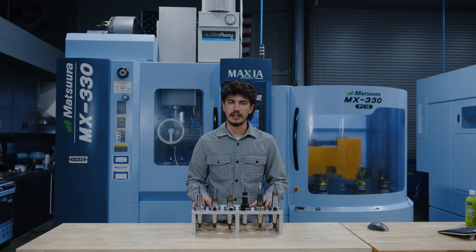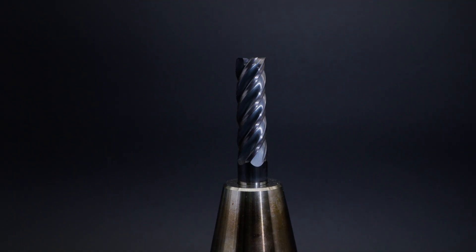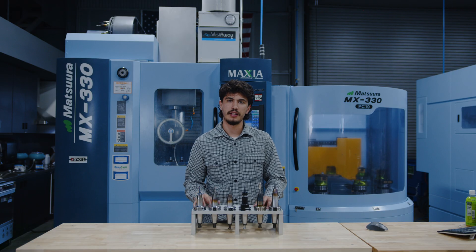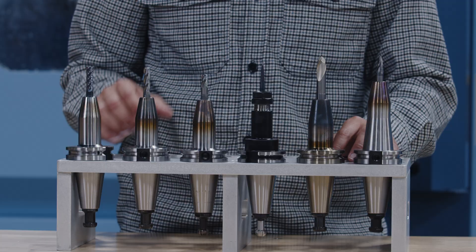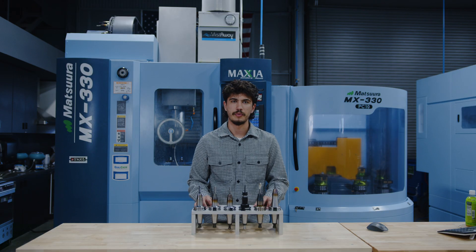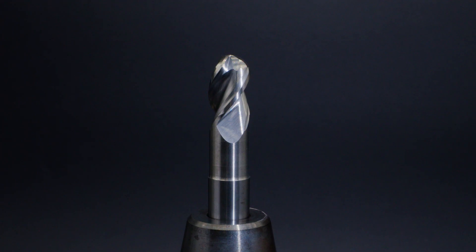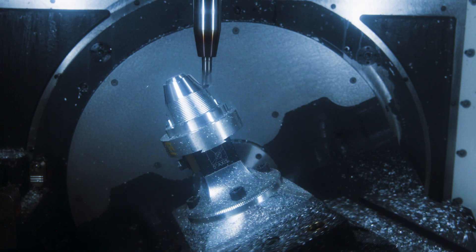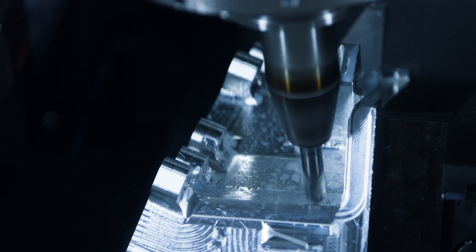To finish floors and walls, we like to use a three flute end mill on aluminum and a five fluter for titanium and stainless steels. Depending on the geometry, the tool may have no radius or a really small one — like this one, which has 15 thousandths on the corner. When our parts have hard-to-reach areas, we like to use a ball end mill. Take this 3/8 three fluter, for example — it can finish a lot of geometry, but it's slower and less efficient than a flat end mill because of the small step overs it has to take.